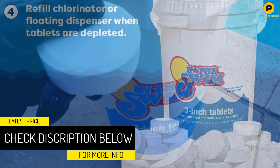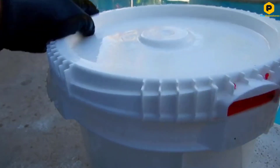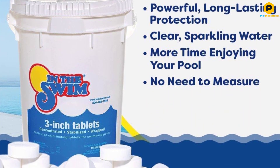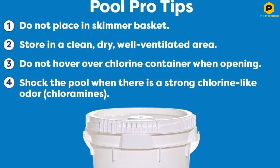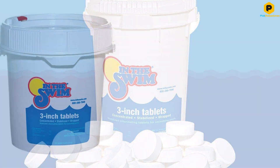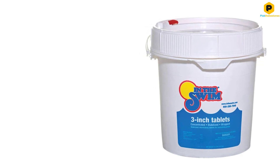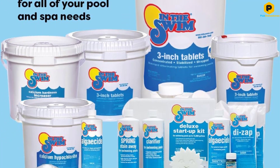It is remarkably effective against bacteria, algae, and other harmful microorganisms. To use this tablet effectively, you have to use one tablet in 10,000 gallons of water for one week. You should note that application varies from pool to pool based on certain factors. You need to apply them at the right temperature, and since they are stabilized tablets, they have to be exposed to sunlight to be used properly. These tablets are chemically stabilized and so will not disintegrate in the water while offering maximum performance. Each bucket contains 14 tablets, giving you enough to last a long time. It works for a pretty long time and dissolves slowly for maximum effect.